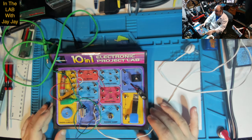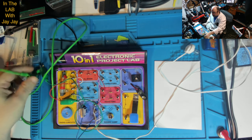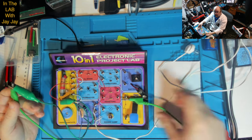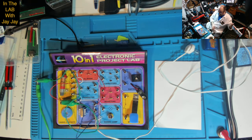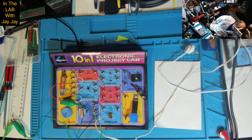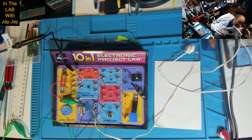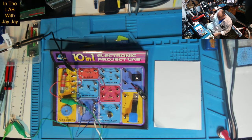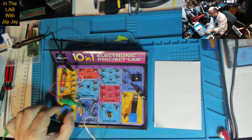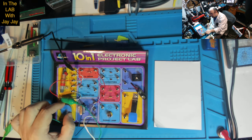Here we are on the bench with our diode radio circuit. I'm not getting any interesting signals. This is our earth lead — an alligator clip connected to the circuit point, running through to the earthing system. When I turn it on, beeping indicates no earth, but connecting the antenna resolves that, giving a good earth connection. Putting the earphone in though — not a peep. Adjusting the tuning capacitor makes almost no difference.